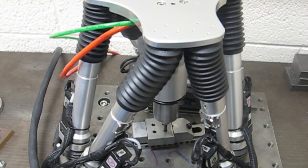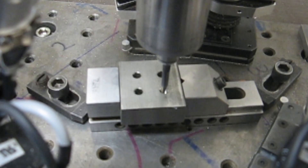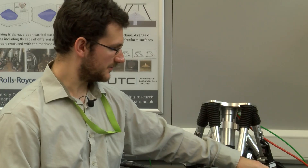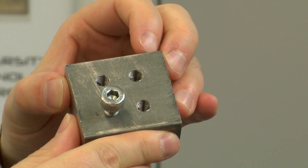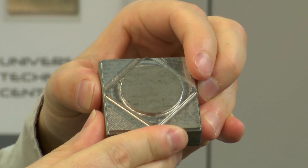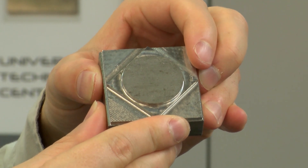The machine can do very interesting things regardless of foot position, provided that the feature stays in the working volume. For example, this is a free-form shape produced using five axes of the machine tool. We have also got here a set of M8 threads produced using thread cutting tools and high-speed machining, as opposed to using high torque with an 8mm tap. The same can be applied to much larger holes such as the M42. This is a standard test piece machined to a high level of accuracy, all performed in one operation.